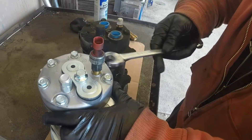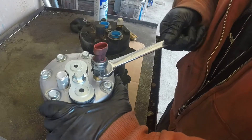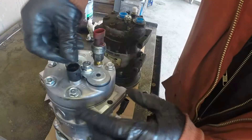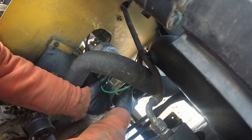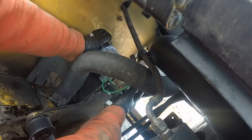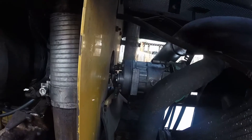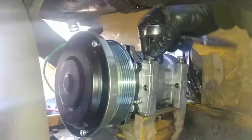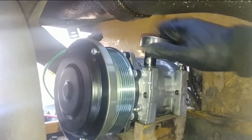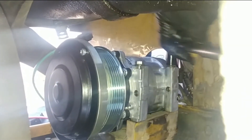The AC compressor probably failed and the clutch seized up. In the woods they figured out how to fix it temporarily — it worked for some time, but the machine came like that from up north, bought from an auction. Place the new AC compressor on the mounting bracket, align those four holes, insert those long clean bolts and start threads by hand with just a couple of turns, then tighten with the wrench and socket.